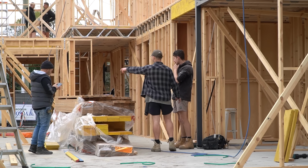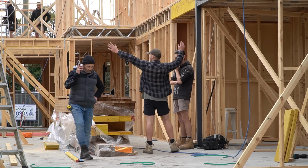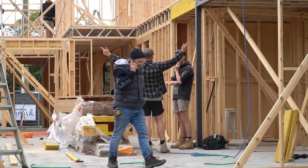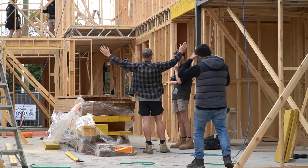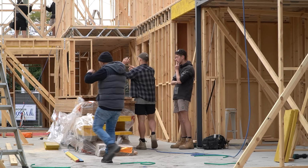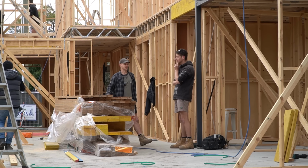And for all the 290s over there, they're all short. We had a look at what the estimator ordered. What he did is from there to there, it's 5.2 over to over. It's 5.2. That's exactly what it is flat. That's what he's ordered on his estimations. So he's ordered all our rafters, everything we need, not allowing for pitch. And 20 degrees, that's added like 500-600 mil.